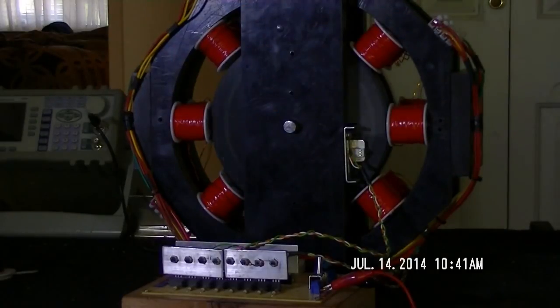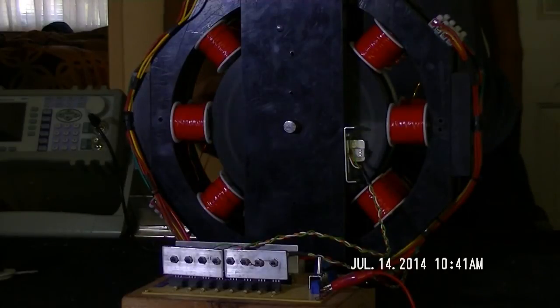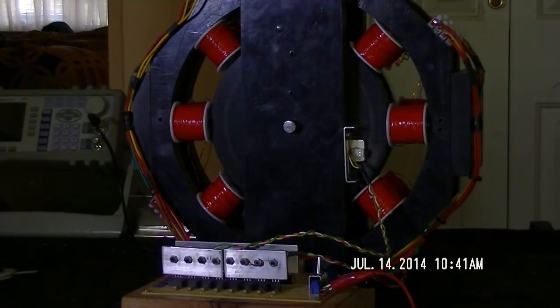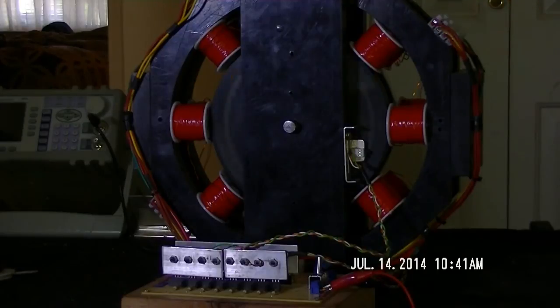Reading about 3044 RPMs, 20 volts. Just over 2900 on this side. That side's coils have a little bit higher resistance than the coils on this side — this one goes faster by about 175 to 200 RPMs. I have to go back in and trim those coils on the second plate so they match, because it's clearly making a difference.